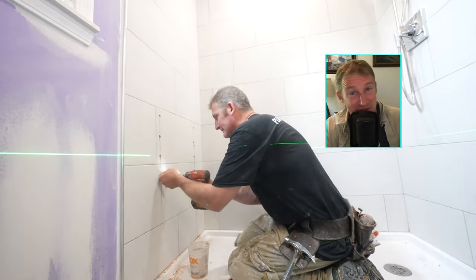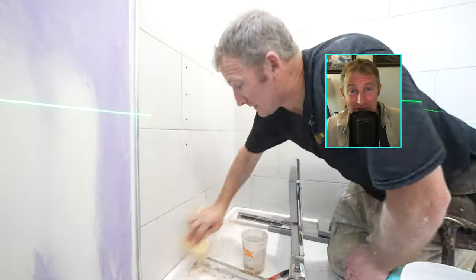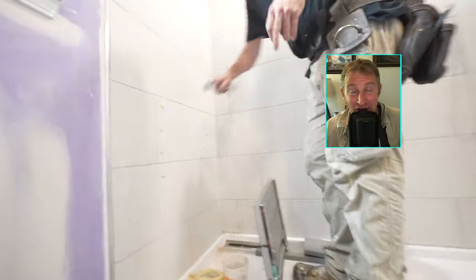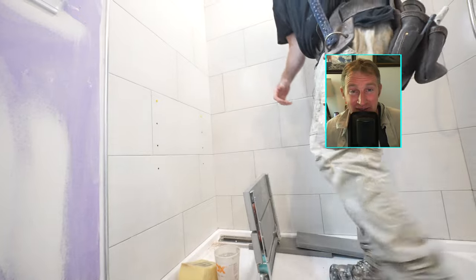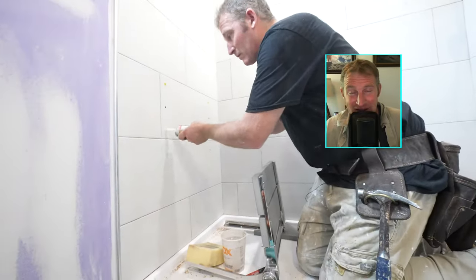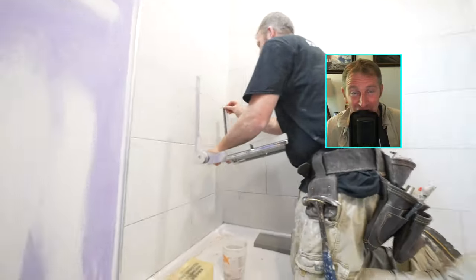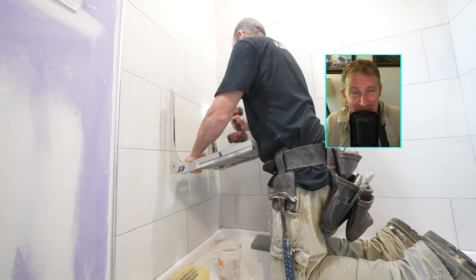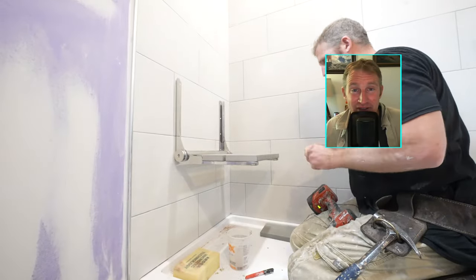Now I did make a little mistake on this particular blocking on my bench. The top screws, I did not have any blocking behind. I miscalculated how high the back bench seat, the anchors were going. So pay attention to that, learn from my experience here. If I would have just had another foot of blocking, I would have had everything secured. But 6 solid screws into the backing here is really gonna be sufficient.